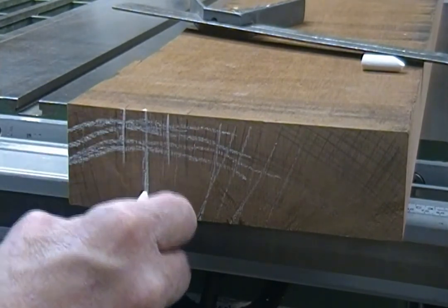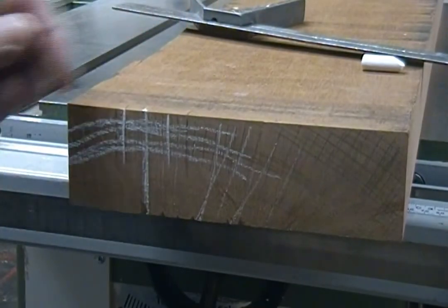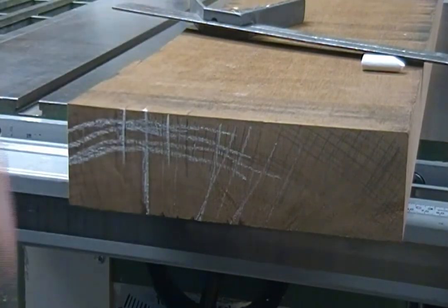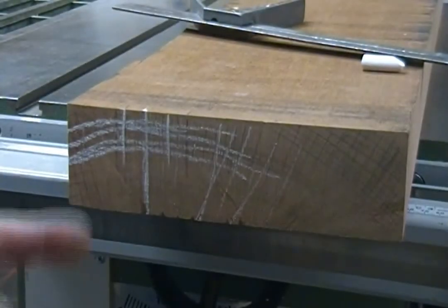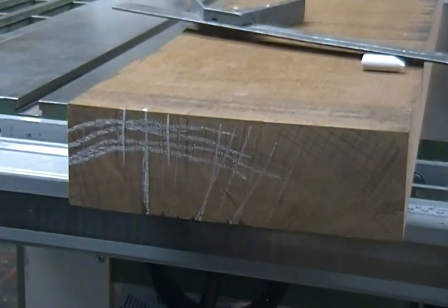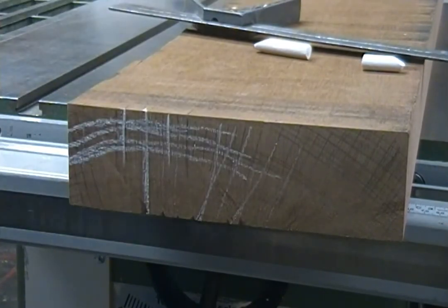I will split this board and rip it on the bandsaw so I have a very thin kerf because I have a 1/16-inch blade. I had set up my table saw to do them, but it dawned on me I should just set up the bandsaw — then I can just change the size of my cut and peel those off as different layers. These will end up being about a 16th of an inch, so I'm going to shoot for just a little fat of that and then sand down to a 16th.